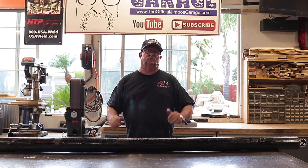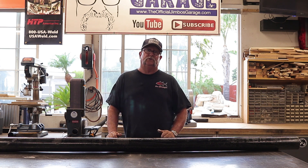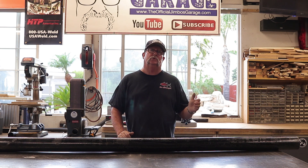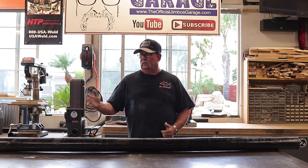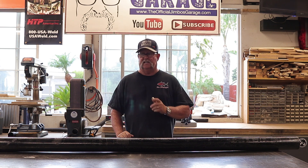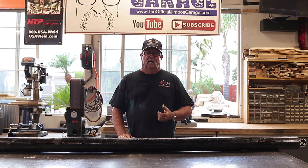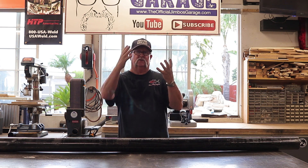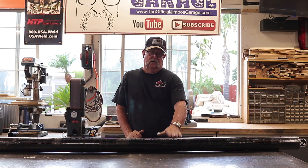It's a round steel column, six foot six inches long. Three inch schedule 40 round tube, and on each end I've got a six by six by quarter inch thick plate. One of the plates is going to be embedded in the concrete footing. The other one is going to have four 9/16 holes an inch in from each corner — we'll take care of that with a mag drill — and that will be bolted to a beam. The existing one has been corroded and rotted out in the corner of the building, starting to collapse a little bit, so we're going to get that replaced with this new product here.